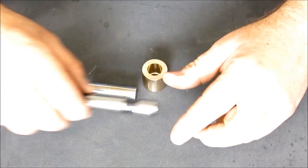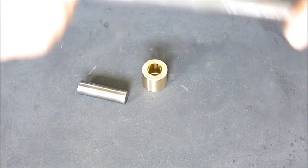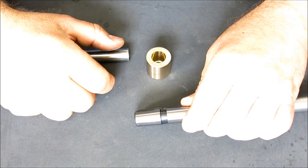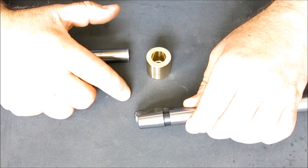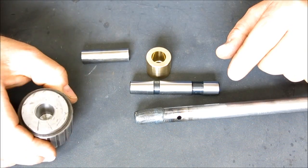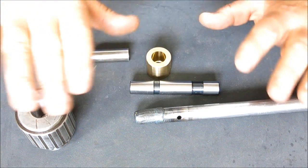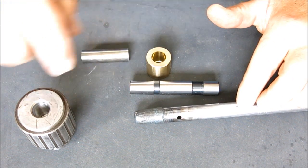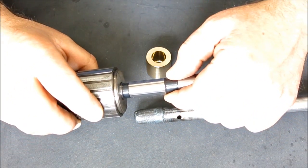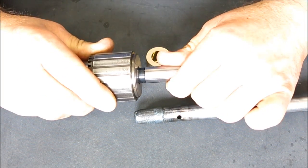Here's the commercial arbor — this is the taper we want to cut on the damaged shaft. Ultimately it'll look something like this when we're done. Here's our problem: we have a damaged chuck and a damaged shaft, so we have no reference. This was all chowdered up, and this isn't exactly looking very good inside either. Normally these two would go together like this, and I can just tell by putting it in that it doesn't feel right.